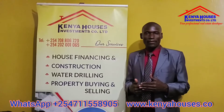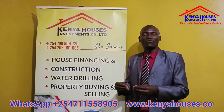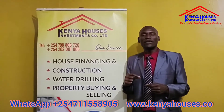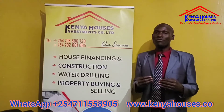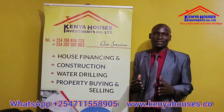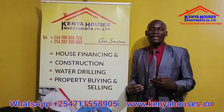During the drilling, you drill as per the layer — you go layer to layer of the soil as you go deeper, detecting water that you have found. There are some areas where the report may indicate that drilling should go more than 150 meters. But maybe when you are drilling, you find good quality water at lower than 150 meters — maybe at 100 meters or 130 meters. You are advised to stop there because the more you drill, the more risks are involved.